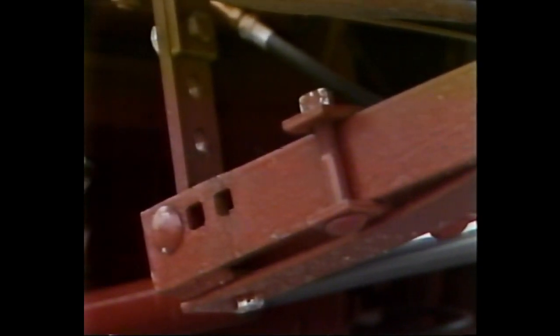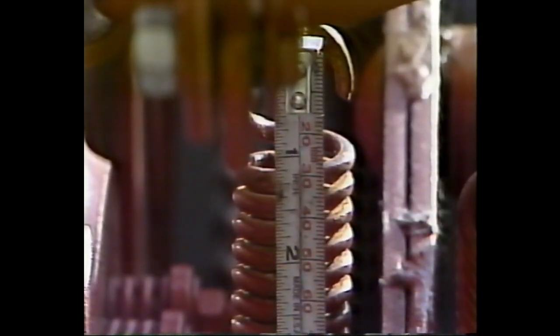Next, adjust the spring tension brackets on the remaining cutter bar arm until the chains at the front of the header start to slacken. It is important at this point to make sure the chains are not slack, but have only begun to show signs of loosening their tension.